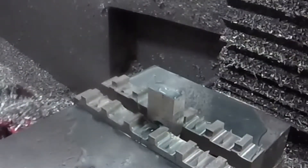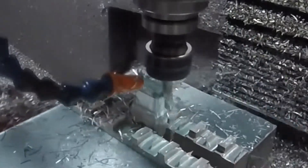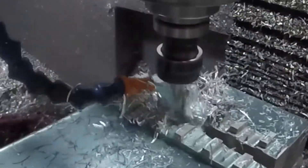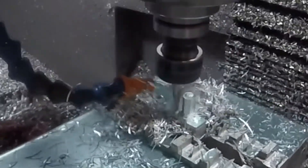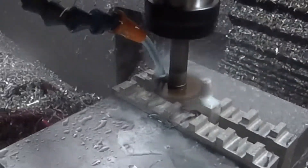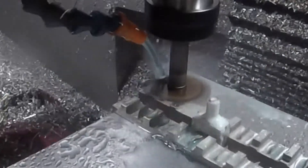So that's the blank cut out with some holding tabs. Pop it out of there and stand it up. This would be the inlet itself where the hose goes. Get rid of most of that material — just a regular 3/8 inch end mill. But then we got to put a shape on it, and here I'm using a large t-slot cutter.